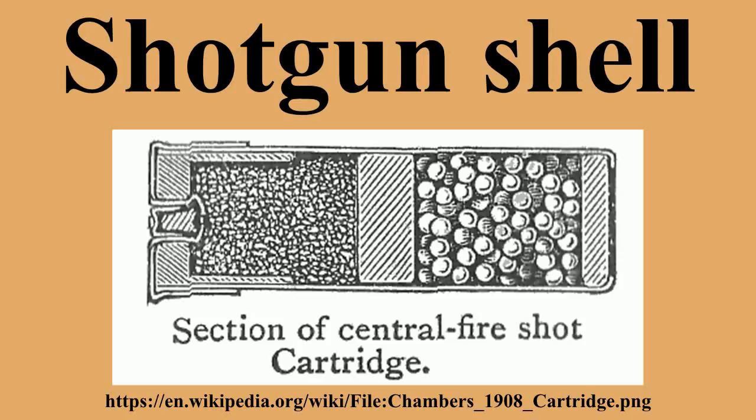A compliance report must be issued for each production lot and archived for later verification if needed. Besides pressure testing, shot shells containing steel pellets require an additional Vickers hardness test. The hardness VH1 must be below 100 for the steel pellets used, but even so, steel is known to wear the barrel excessively over time if the steel pellet velocities become too high, leading to potentially harmful situations for the user. As a result, the measurement of pellet velocity is also an additional obligation for shot shells in 12, 16, and 20 gauges in both standard and high-performance versions sold in Europe.